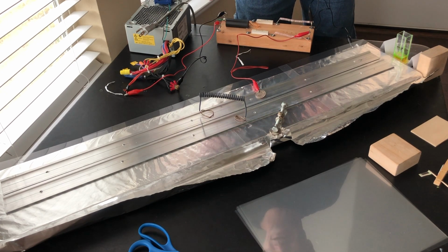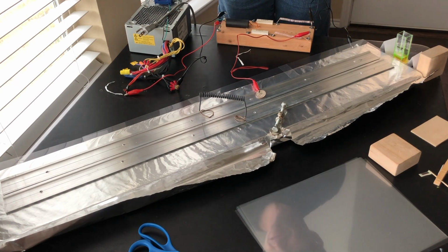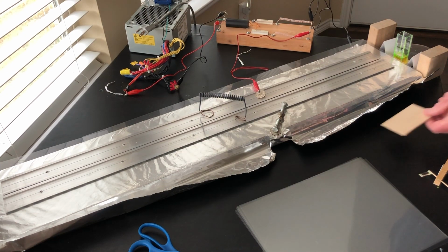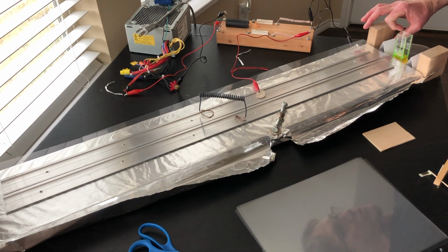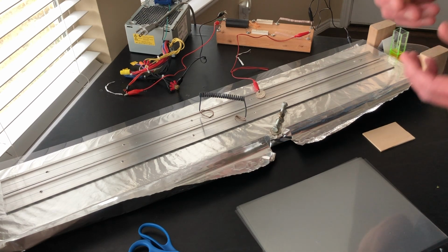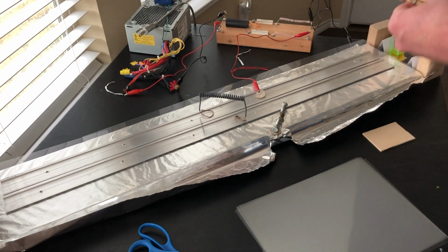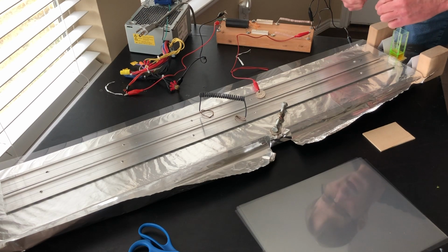And as that electric current goes across there, a laser beam will be generated by the nitrogen that is in the air between that channel. And I'm putting this here just for protection. The beam won't burn anything except the retina of your eyes, and I want to make sure I've got safety blocks here to block it so that it doesn't go anywhere else. I've also got these little paper targets so that we can see the actual output. Now here is the lens that has to be used. It's a cylindrical lens to focus the beam to a line on that dye, and I will cover that in a little more detail in another section of the video. And I'm going to put this right here.